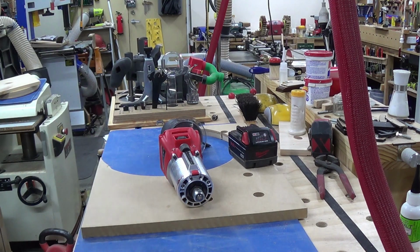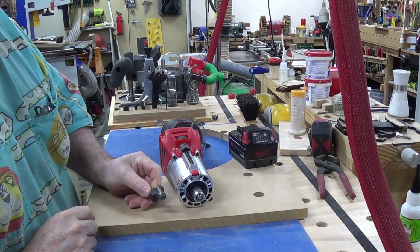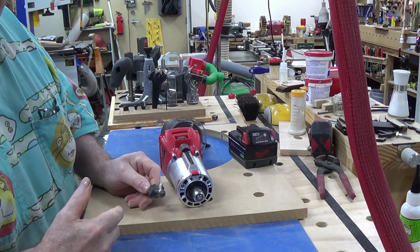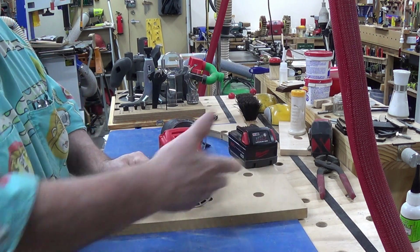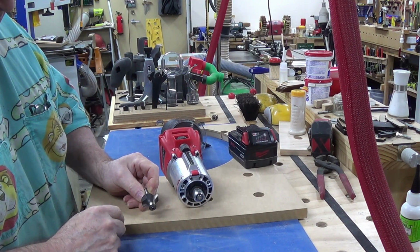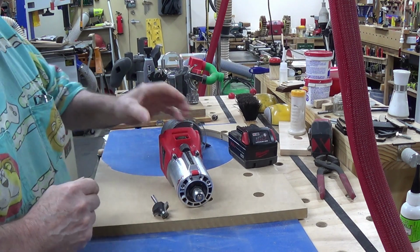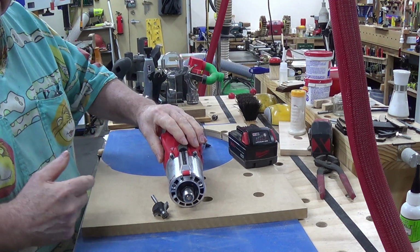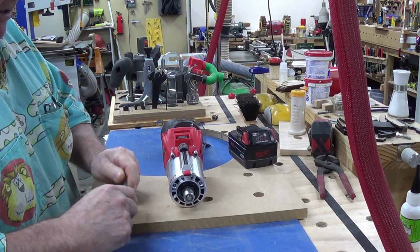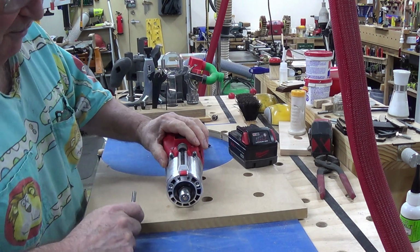I'm back. I found a couple, but I did find this one. I went for the bigger one. I thought, well, bugger it, let's put this under a bit of strain. I didn't want to use a straight bit because a straight bit isn't going to put that much strain on it, well, unless you cut straight through like that. And I didn't particularly want to use a tungsten carbide tip bit, because with the tungsten carbide, that does most of the work, not so much the trimmer. What I just wanted was a normal run-of-the-mill garden variety bit, so it will put a bit of, well, hopefully a bit of labour on this.